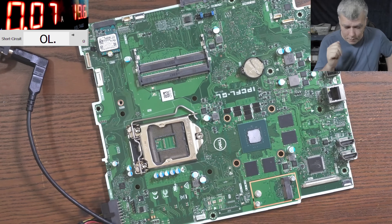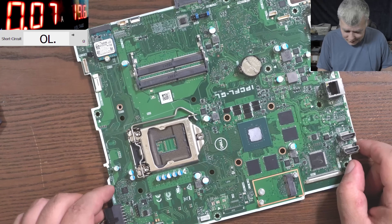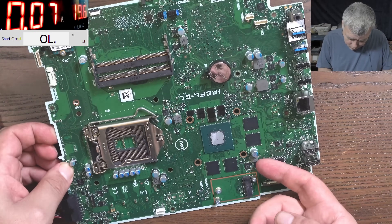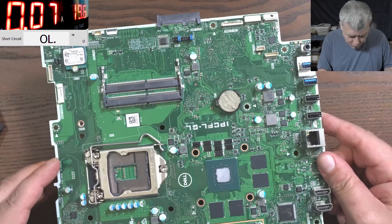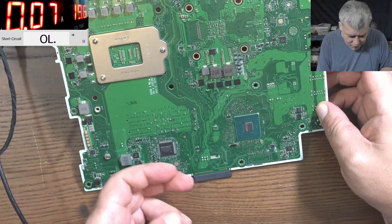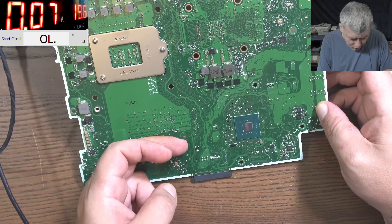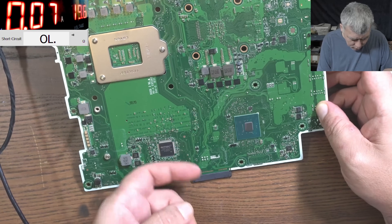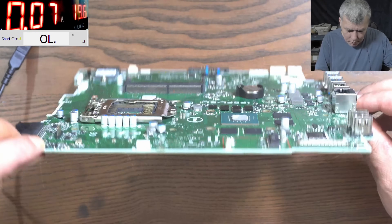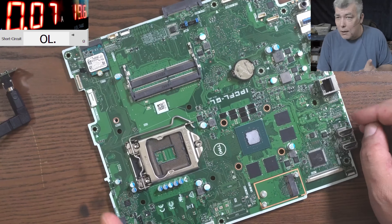Where is the EC chip? Most likely we're dealing with the EC chip. There's the SMCS chip — yeah, that's the one. And here you have the chipset. It's not warm, so let me grab the thermal camera to see what's drawing those 70 milliamps.